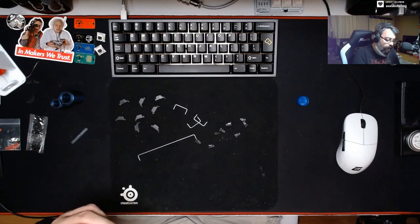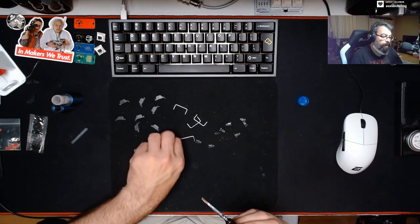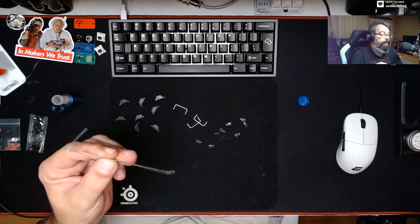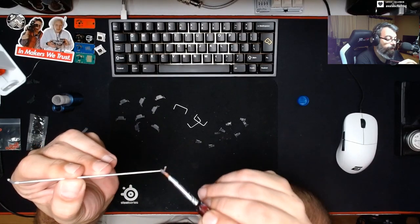Now with regards to the wires, you should coat it a bit more than the housings themselves. So the idea is to put a more generous coat of Krytox on it, so that they would look like this, right? That would probably be the best thing to do.